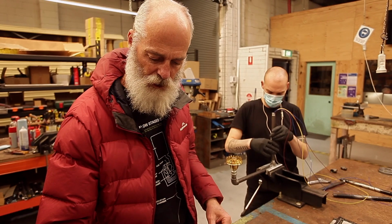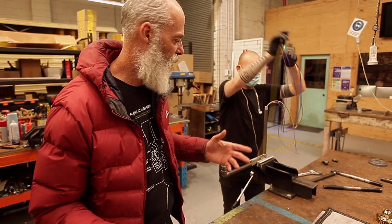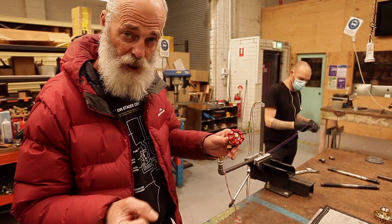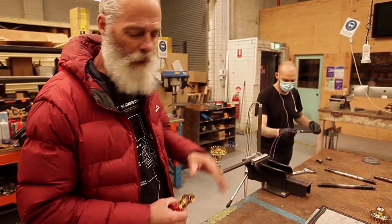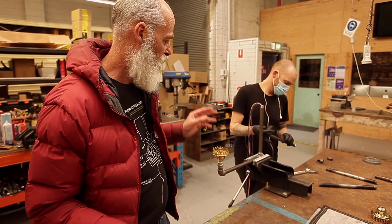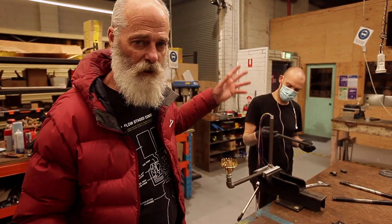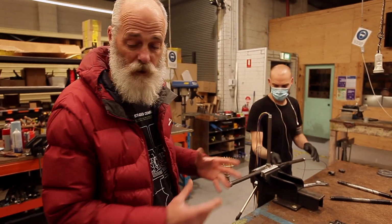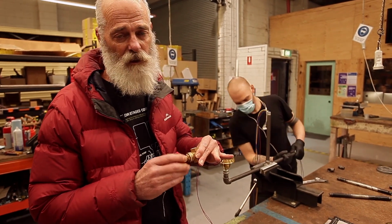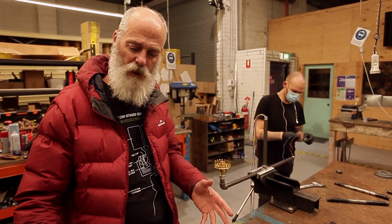And what we're trying to do is just to recreate the gaslight feel, so that we have a replica as best we can. Now, probably what we will do is we will make a lever with the chain for this type of tap. However, when we are making one that is dimmable with a dimmable tap, we then have to make the whole thing low voltage, so that there's no disconnectable wires within the plumbing pipe construction. And also it gives us this type of dimmer, which is separated from the power dimmer. It really is just a little pot that adjusts the driver as such.